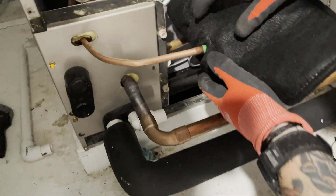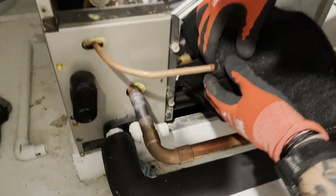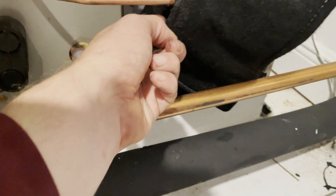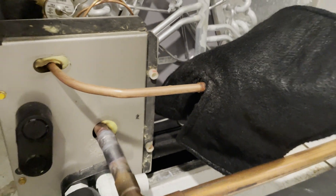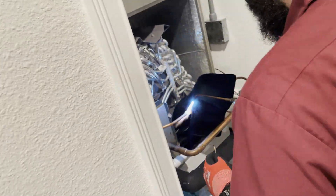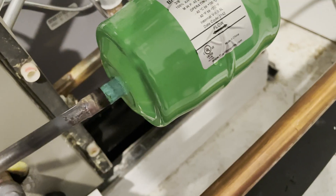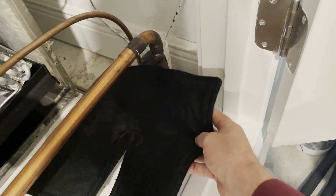All right, let's give it a try on the line dryer. Pull it in snug, and then we're trying to fold it over enough that we're not letting any flame past — of course giving yourself room to actually braze. If you don't have room, just position it differently or let it hang. There is a gap on the bottom, but this should be enough room that you can give your flame angle if you need to actually direct your flame angle to hit the rag instead of the line dryer underneath. All right, let's see how this looks. It's amazing — beautiful, I love it!